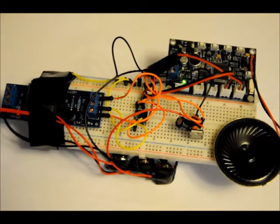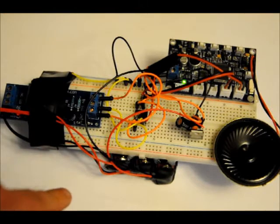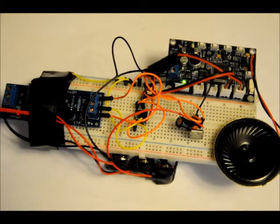I've got three batteries down here. One is powering this circuit, and two of them are powering what's going to be a short across a piece of nichrome wire, a piece of filament. I've got my filament right here. And what's going to happen is when the relay turns on, it's going to act like a dead short across the filament, shorting these two batteries and creating a hell of a lot of heat on that piece of wire. So while I'm not going to waste my filament right now, I'm going to show that to you outside in a minute.